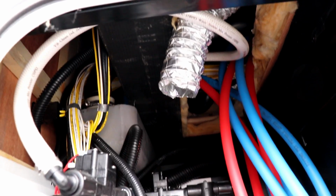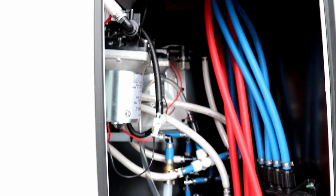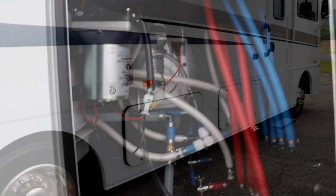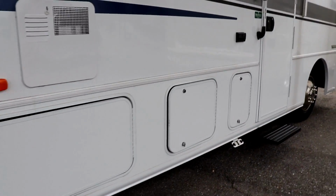But notice also that you have a heat duct. It's blowing heat right into this area, so that's going to give you an extended camping season. Now, another thing that they do, instead of having the disconnect on the inside where it's a button, they have it in here, and notice that it is an actual knob. Benefit of the knob, regardless of what power is on the batteries, that will go ahead and open the circuit so you can get those batteries charging again.